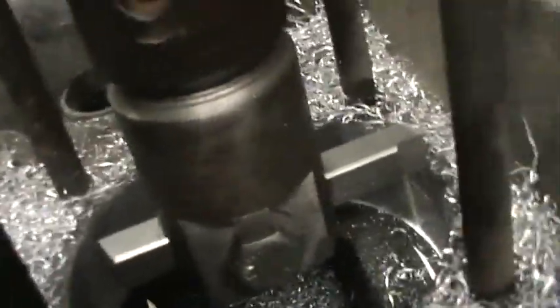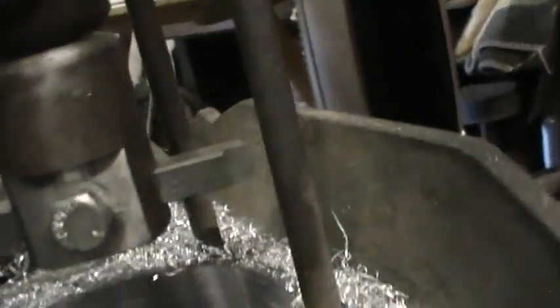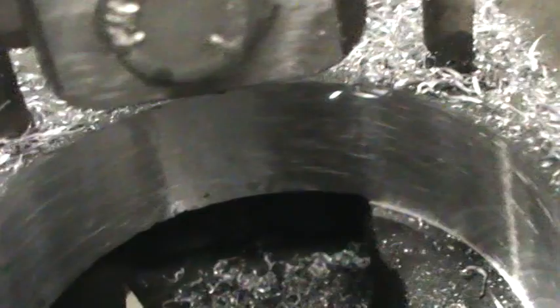Okay, that is pretty successful — that's just the first pass. You can see that tool a bit better now, just machined it down to about 16mm in here. Took it as big as I could to fit in my chuck, just drilled a hole in it, and just took a slight little grinding off the edge of the tool steel, so I had a bit of surface when I locked it up with my locking bolt. As you can see, it's not doing too bad for a job at home.